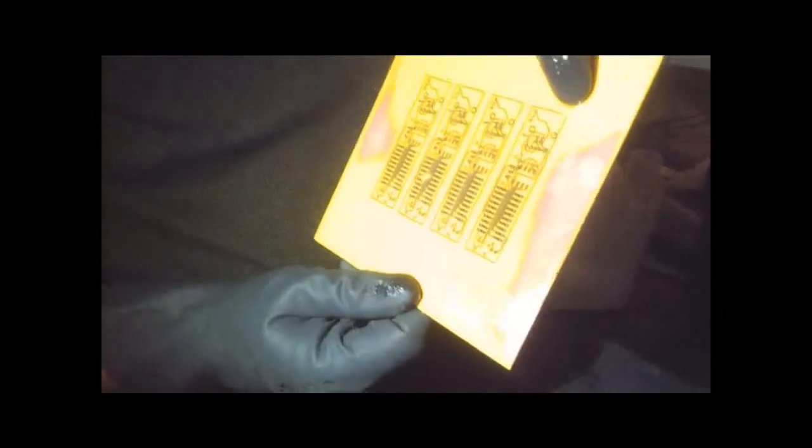And you're doing all of that visually, hey? Does it etch evenly? You don't get sections where it hasn't etched enough and you've now got tracks that are slightly joined. I've never had a problem with that. By the time you don't see any copper near the board, you can pretty much trust it. That was more from, it's not an etching error. That was more the toner that lifted while we were still ironing it. Okay. But it's fine because it's just my outline for me to know where to cut later.